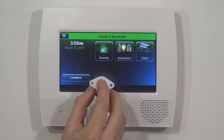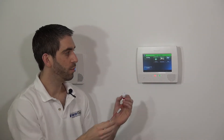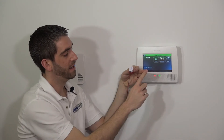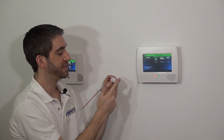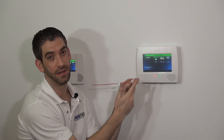The 5800 RPS is a single device — there's no separate magnet and contact; the plunger is everything. Where surface-mount door and window sensors using a magnet are normally mounted on the opposite side of the hinge, with the plunger style you want to install this on the hinge side. As soon as the door opens, the side of the door holding this down pops open, and the switch pops open. You don't have to have the door opened all the way for it to pop out.